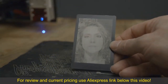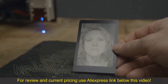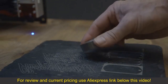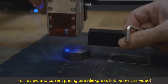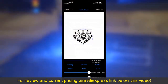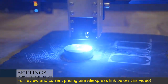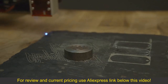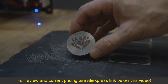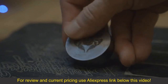Great engraving. Now we come to a material that previously could not simply be engraved with a diode laser — stainless steel. Is it really possible to engrave stainless steel with this laser without additional tools? We will see. The settings are 100 ms carving time and 100% laser power. I'm excited. It worked — it's actually engraved.